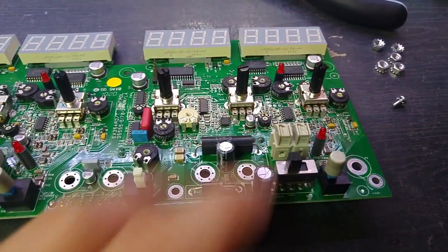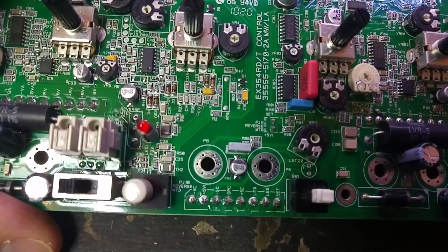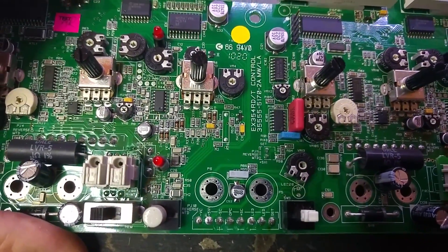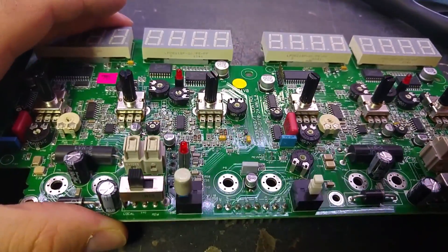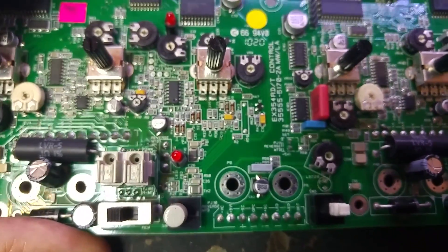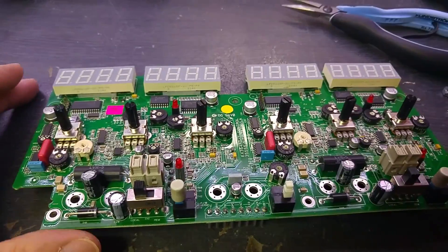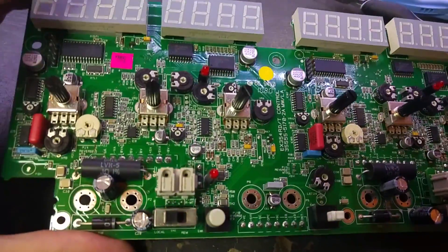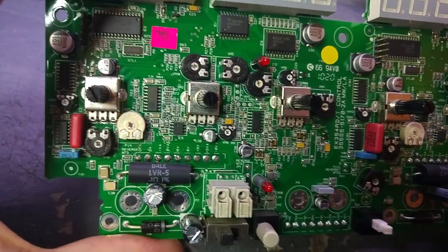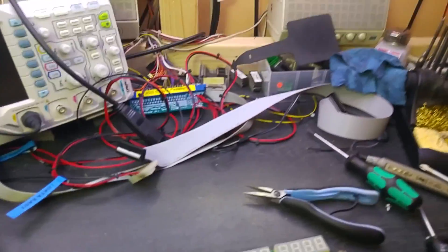This is the right output. There's also a third output which is actually fully populated — yes, there's a third output on the front control panel, maybe apart from a capacitor. So this board can be used on the triple-rail version as well. Anyway, let's find out what's going on — there must be something shorted.